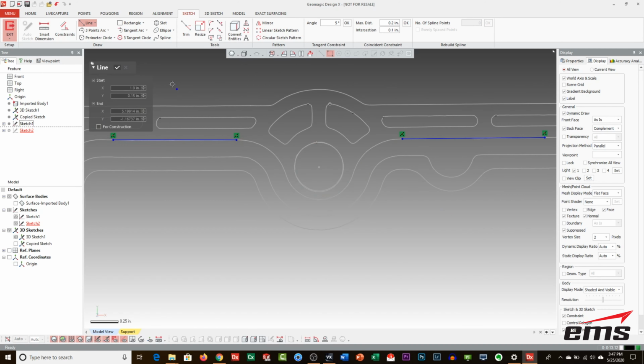Now here we've got a circle, and more than likely at least the outer circle will share the center point of this one here. It looks like more in the outer one. So for the inner one, I'm going to do the three points again, fit that. And then I trim off part of the circle. At least in this program, if I don't do that, it sometimes has trouble figuring out what part of the circle I want to keep. This will make sense in a second.